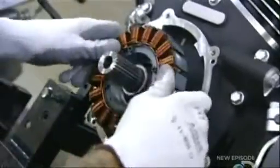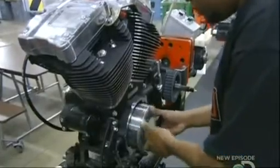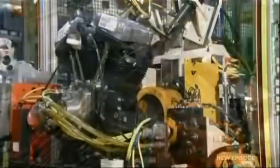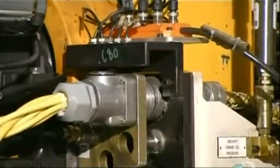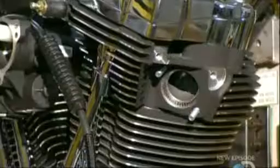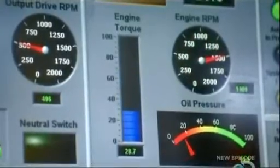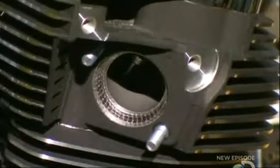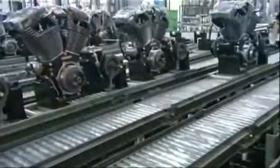This is the electrical charging system — it goes on the crankshaft. Now it's time to pump oil into this V-Twin engine and put it through its paces. Computerized testing equipment moves in and mates to the engine. The engine rotates and they shift the transmission through all the gears, allowing the testing equipment to analyze every aspect of its performance. Next, they insert spark plugs into the cylinder heads, and these 1584cc motorcycle engines are now revved and ready for their wheels.